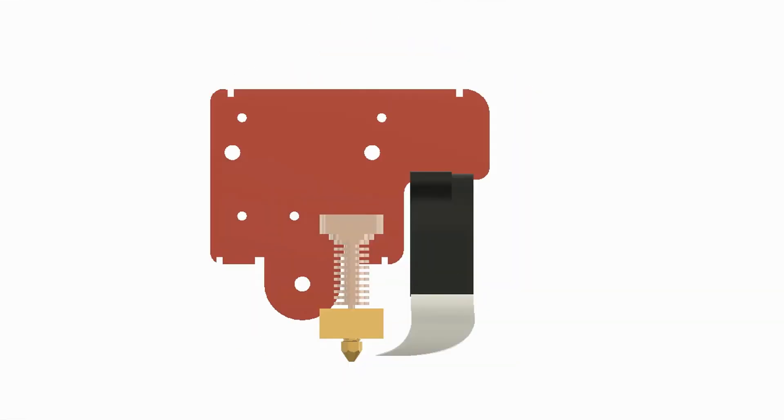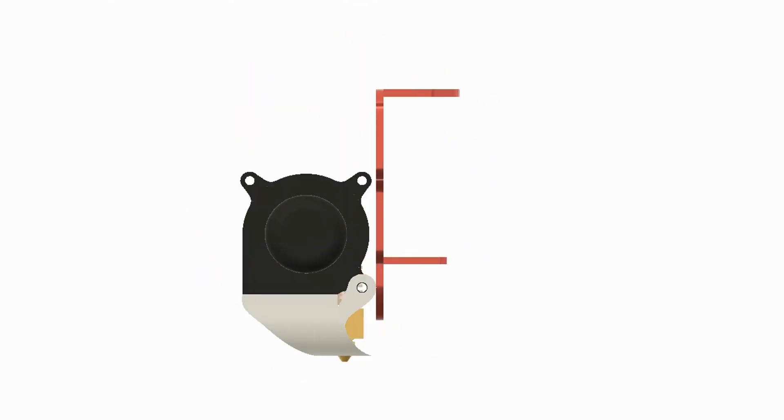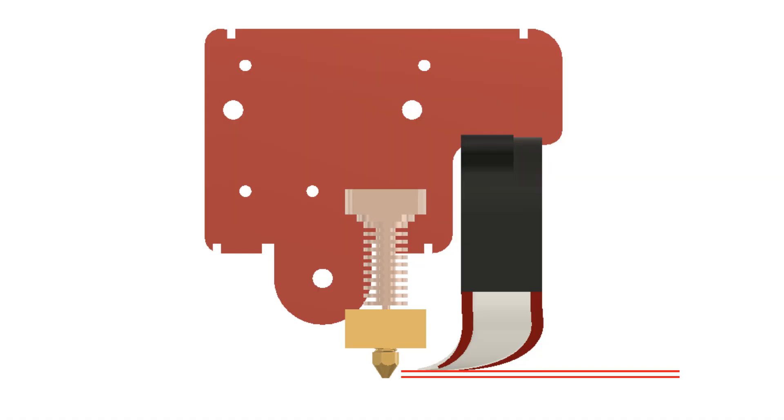Next I needed to come up with a shape for a part cooling fan duct. As long as it misses all the parts the shape doesn't really matter that much, but what is important is where the air goes. You want the duct to point at the area around the nozzle to cool the filament that's just been extruded, rather than at the nozzle itself where it will cool the filament before it comes out. The lowest part of it also needs to be a few millimetres above the lowest point on the nozzle so that it clears your print.